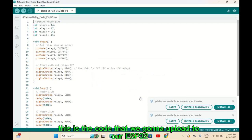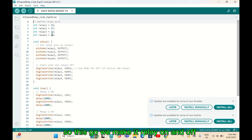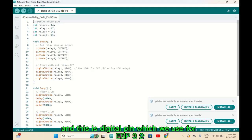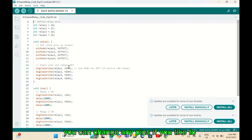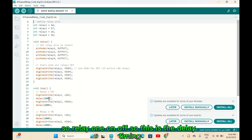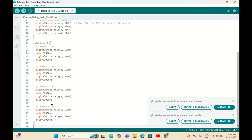This is the code we're going to upload to our ESP32. We're using four channels of the 5V relay, and these are the pins used: digital pin 14, 27, 26, and 25. You can change any of the pins if you like. The code will make each relay turn on and off. This delay timing here you can also adjust as needed.